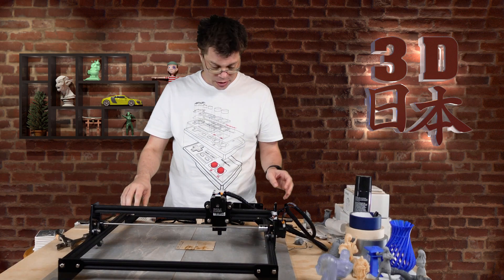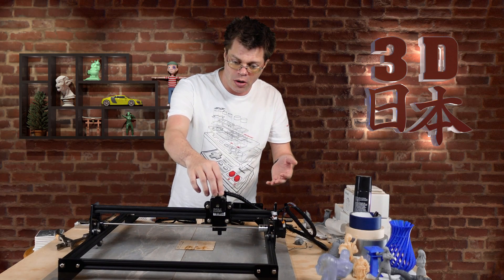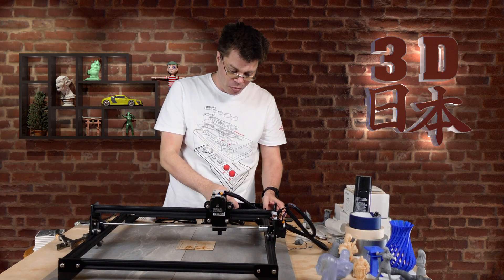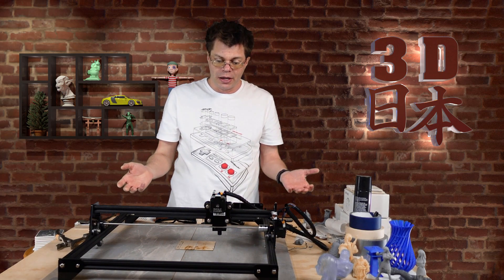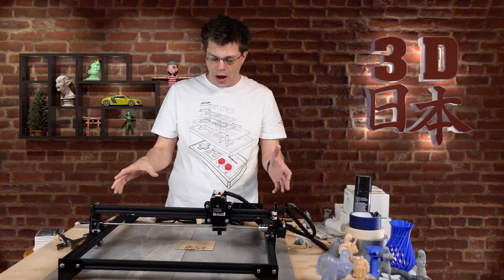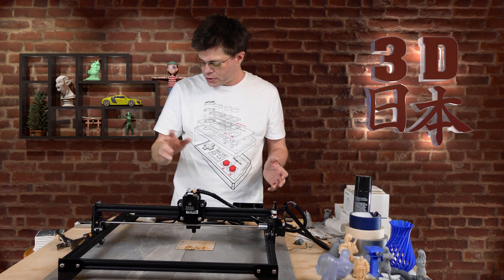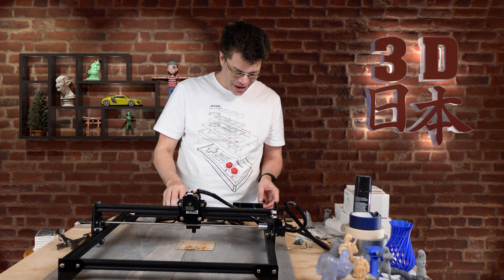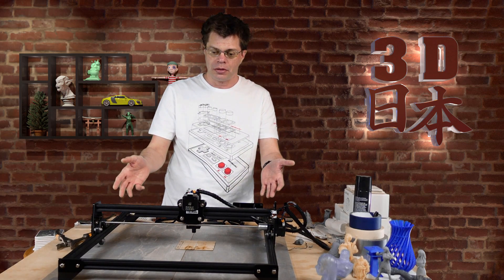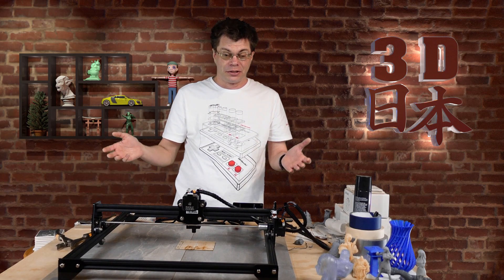One problem — and there was some blood involved with this — is setting up the cables. Plugging them all in, most of them click into place and that's fine. But this one that connects to the control board just will not click in. In most cases it's fine, I can just leave it because it only moves around very slowly. But if you're doing some high-speed engraving, it is possible for that cable to shake loose and then the laser will just stop. So if you've been going for a couple hours and suddenly it just stops in the middle, you're going to be kind of annoyed.